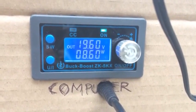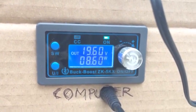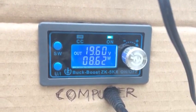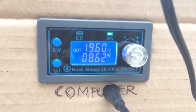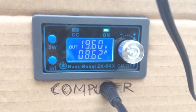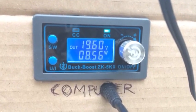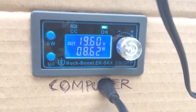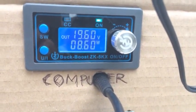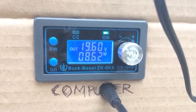In this case I'm bumping up tension from about 12 to 19.6 volts, which is the amount required by my laptop. Other kinds of laptops may require a slightly different voltage, so you better read on your power supply. You can see also how much power I'm consuming now — my computer is not doing anything, it's only switched on, but it may go higher if you use it while doing some processing.